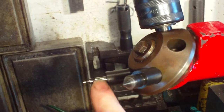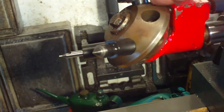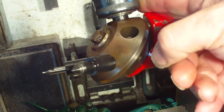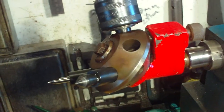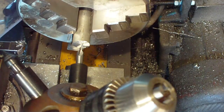There's a little holder there for a center drill, a small live center that I've made, and also the arbor to mount a 30 millimeter Jacobs chuck - so I can hold drills in that one, send a drill in that one, and hold it while I'm turning with that one. So without further ado, here we are with a little bit of aluminium in the lathe. First things first is the center drill - I've roughly faced it off, it's not perfect but it'll do for now.